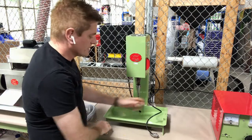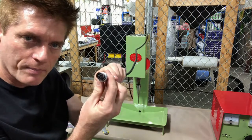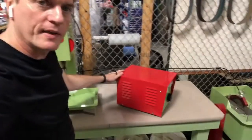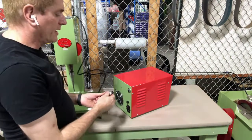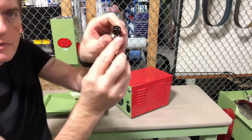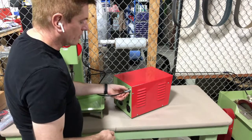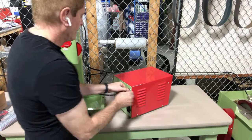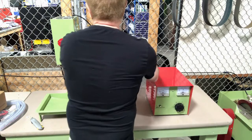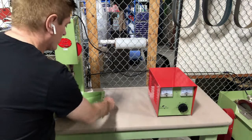I've got my connector. This connector here has five pins on the back. We had two versions of this — there's one with a four pin, one with a five pin. This is the five-pin version. As you'll see as I turn the camera around, this cable connects to the outlet in the back here. There's an alignment place that'll line it up. I'll slip it into place, find that alignment spot, pop it in all the way, then screw the collar on. I usually like to have a little distance between my amplifier and my piece because this does throw some water around, so pay attention to that.